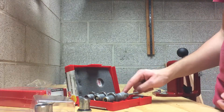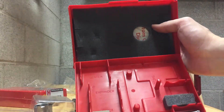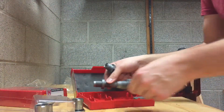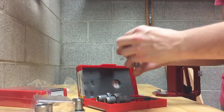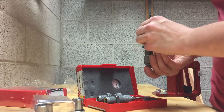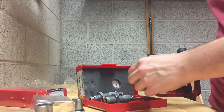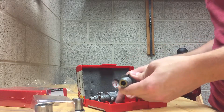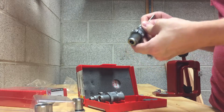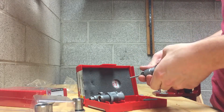There's a spot for the shell holder in here — that's kind of nice. It's even labeled in there for the shell holder. Unfortunately, the shell holders don't come with the die set; I did have to buy those separately. This appears to be the seat-and-crimp die, and they're labeled underneath where they are — expander button — and the one with the decapper on it. I'm just gonna screw this down a little ways and lock it in place.